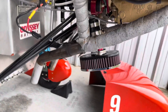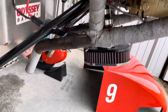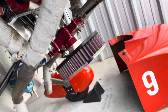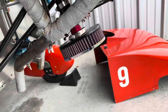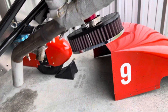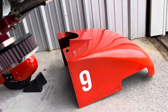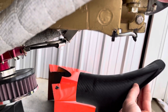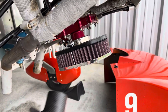What I'm going to do is take this pipe and drop it down straight out the bottom of the cowling, like you would see on a Skyhawk. We've also added a new K&N filter — this is a K&N 1980 — which is a bit of an upgrade from the original filter right here. And because there's absolutely no airflow in the cowling out the front, I'm going to add a NACA duct to the front to bring some airflow directly in underneath the cowling at that K&N filter and also out the back.